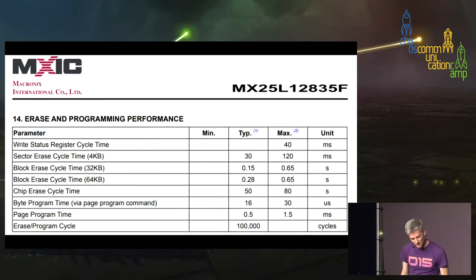[Question]: Is there a whole-chip erase command that's much faster than sector erase? It's still pretty slow. The whole chip erase command takes 80 seconds. Typically that's not an optimization because a lot of the chip hasn't changed — it would erase the management engine section, which is probably the same between flashes unless you're working on ME security. So a full chip erase would require reprogramming all of that. Plus the page program time is 1.5 milliseconds per 256-byte page, so overall it's a loss.